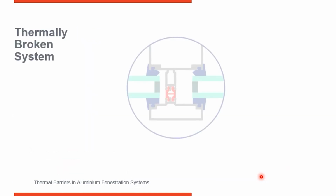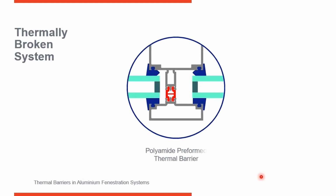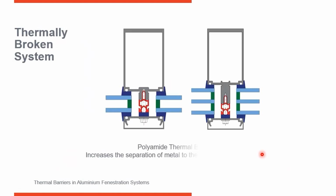So this is a polyamide insert in a curtain wall. This is a polymer piece that's combining 2 extrusions together, and it is crimped in place and chemically adhered. So this is bonded together. So you've got your interior extrusion, exterior extrusion, the polyamide shape popping between them. Polyamide has really been growing in popularity. Most manufacturers are offering different types of polyamide inserts.